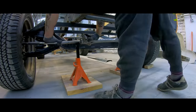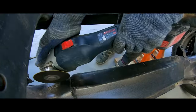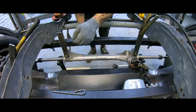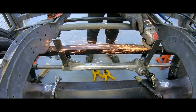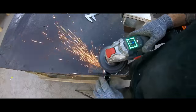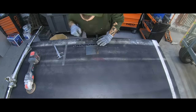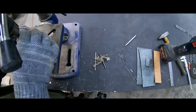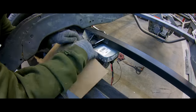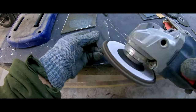First of all, we fit the modified steering rack and measure it to figure out what the mounting is gonna be. The next step is to figure out the anchors and other pieces that will help us install it all on the van. This part is pretty clear. The metal is thicker, we have to weld more to fit over and over again.